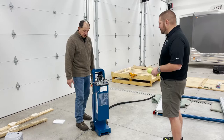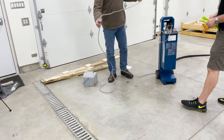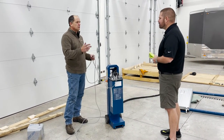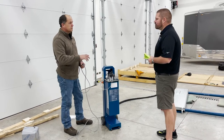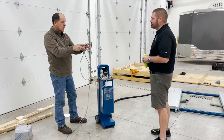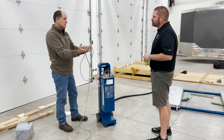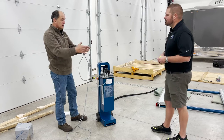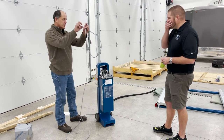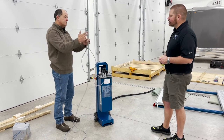So they try to make you the Maytag repairman, right? Which is you get to get out and sell and do less repair. It's different, because if you look at your typical import two-post lift, it has what looks like an electric motor with a little aluminum block, which is their valve block. And then there's a pump attached to that on the bottom side, and a big plastic jug. When those go bad, most people take four bolts out, unwire them, throw that one in the trash, and put the new one on.